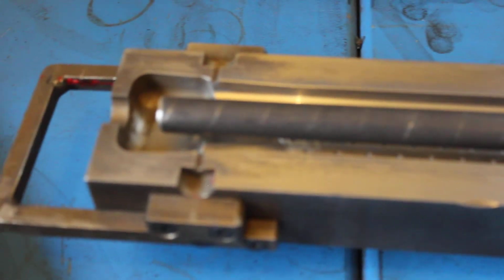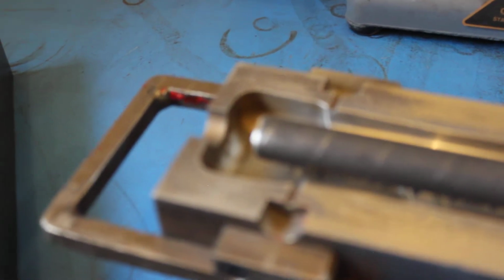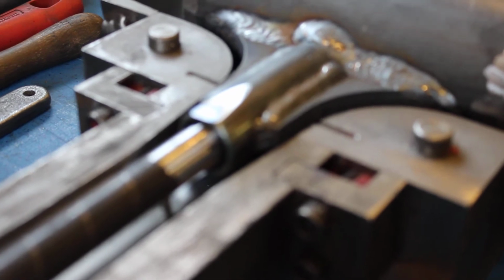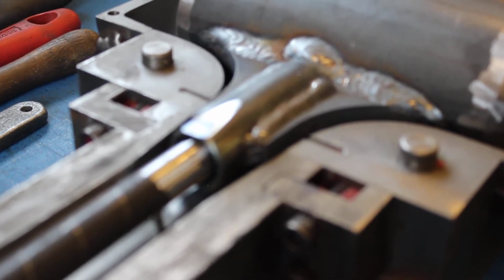When we cast the urethane, we preheat this mold and we pour our urethane in from that little half moon shape you can see cut out. That's where the urethane comes in, and we fill the whole chamber of the mold, casting the hammer. The handle is held in position in the neck tube by two machined grooves in the neck and machined curves into the handle, and it interlocks everything together with urethane.